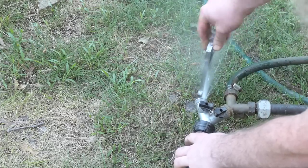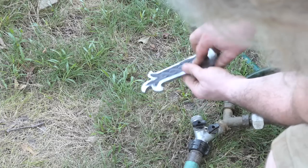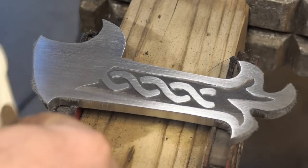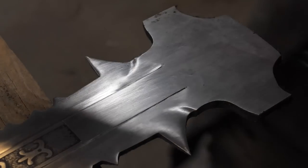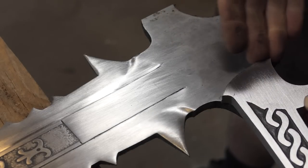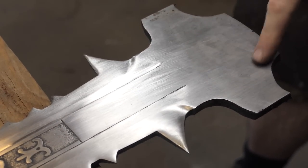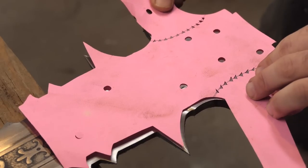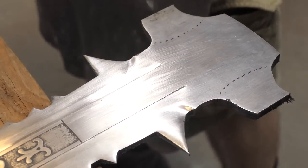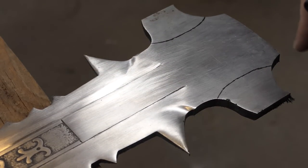You rinse off the cold blue solution to neutralize the acid, because if you don't neutralize the acid, it acts as an agent that makes it rust really quick. The water will make it rust too, but you can just dry that off. Ta-da! Now because of the way I cut these guys — they go like this — I want to give them this curve because that would make the weld stronger. But that means I've got to draw a line and then cut. These are gonna have to be mega accurate because I want to leave a little gap for the weld to get full penetration through.